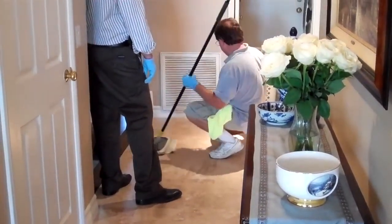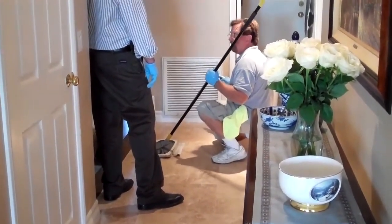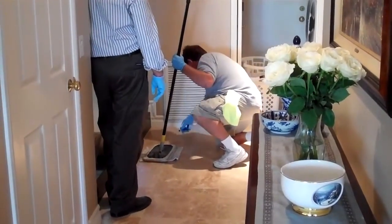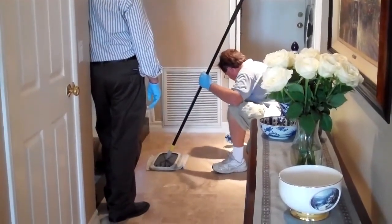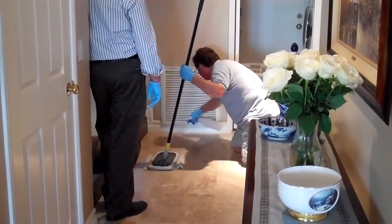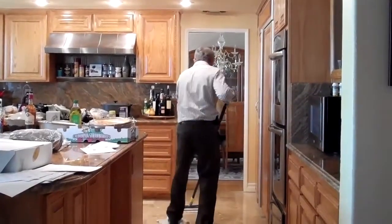One caution: up against the wall, you do not want to get your sealer on their wood. The reason for that is when the painter comes in behind you, the paint runs off the wall — it will not stick. So you want to get close, just do your grout lines. See how they go dark instantly? So you know you're getting it. Normally there's grout right there so you want to just shoot the grout. It's about 50% — just start buffing it off.